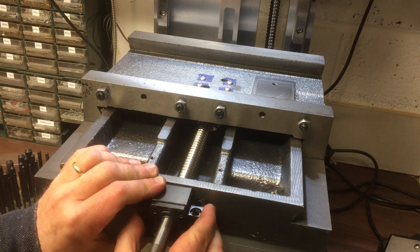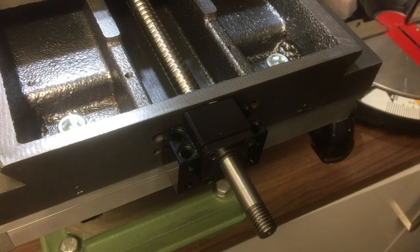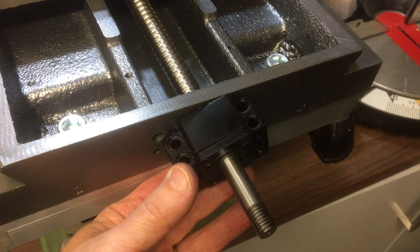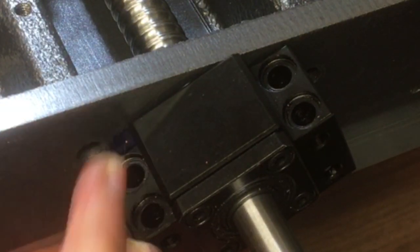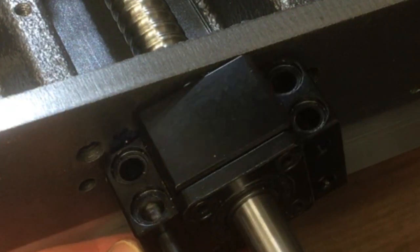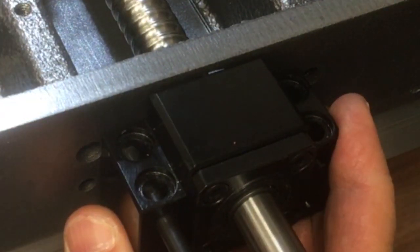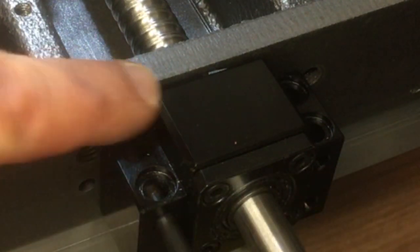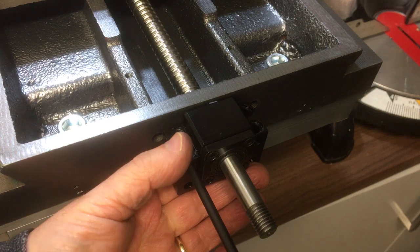Let's say there. Okay. I'll just have a look down here and just see if that's stood in about the right place. Now it's a bit dark to look all the way down there with the camera, and I can barely see it myself, but it is pretty much in line, so you can see the little witness mark just there from the previous hole. And what we can do is just feel that. Yeah, I can feel it's gone into the little hole there, and this looks level and fine. So let's drill and thread that, get a bolt in, and then we can take it from there.